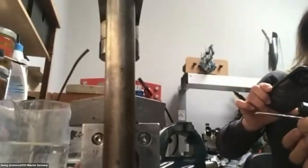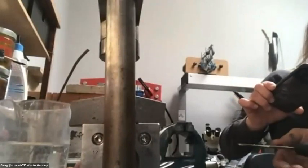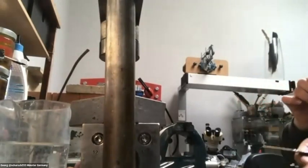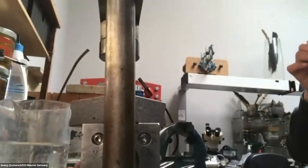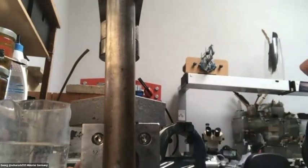Yes, and right now, I burned in the tang, I cooled down the blade again. I will take off the tapes now. You can always go and shorten the tang a little bit more. So I would not glue it to the very end and mainly heat up the tip of the tang, because usually you don't need to go too far to the cutting edge, to avoid heating that up. So this is now a little bit messy. This nice new blade is a little bit sticky now. Usually I would clean it up nicely. And if anyone's interested, that's the stage I normally cut myself, taking the tape off.